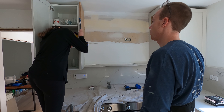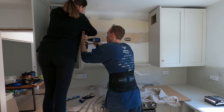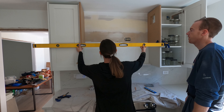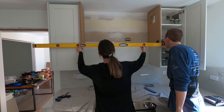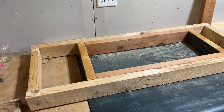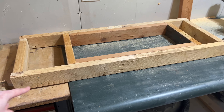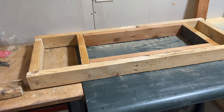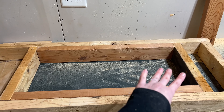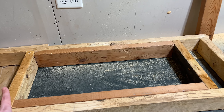Because we're working in between cabinets that are already installed, we decided to install the face pieces first and then measure and cut the framing for the hood from there. We got the bottom framing of the hood done. We've got a four-foot wide by one-and-a-half-foot deep frame, with additional framing in the center where our actual mechanical hood is going to be mounted — sized based on the directions we received.